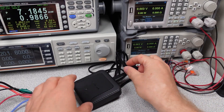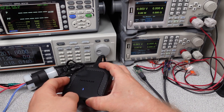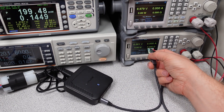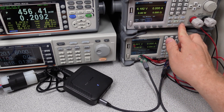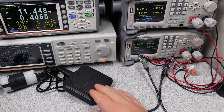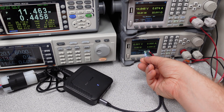The first thing I see is this power adapter has reasonable idle power consumption — a good first step. For the modes of operation, this adapter has 5, 9, 12, 15, and 20 volt fixed USB 3.1 power delivery modes. The power adapter also has a programmable power supply mode, or variable voltage mode, which can be more efficient for charging at 20 volts. This can go up to 3 amps, so this should support 25 watt Samsung fast charging. The power negotiation is the same as most USB power adapters — any plug or unplug causes renegotiation of all the outputs.